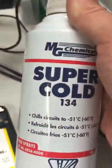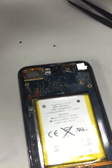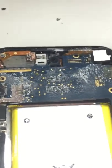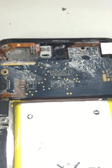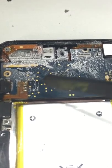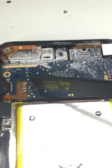This is a can of freeze spray, and we're going to freeze the logic board up here where it's generating all the heat. Normally I would remove the cameras and not freeze those, but in this case I have some replacement cameras. So if I'm able to get this iPod restored and the camera no longer functions because I just froze it, I'll replace it with another one. You can see the freeze spray is melting first right here, which is interesting because this is the area that generated the most heat — around 140 to 150 degrees here, but only 130 over there.